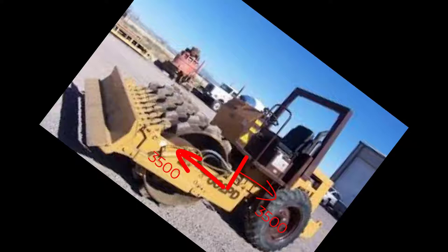Now let's say the operator places the drum in high speed and leaves the drive axle in low speed. We made the drum motor smaller, which means it'll take more pressure to produce the force necessary to break traction. Now the pressure rises and becomes high enough that — let's say at 5,000 psi — the machine climbs the hill without spinning. If we looked at how much load each motor carried, it may be 30% on the front and 70% on the rear in that situation.